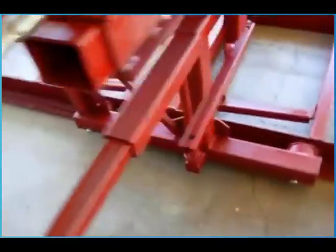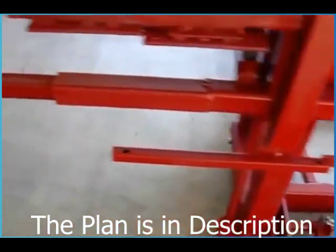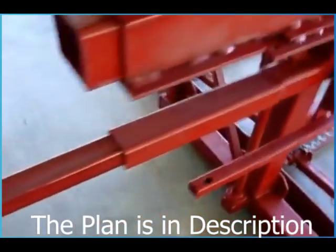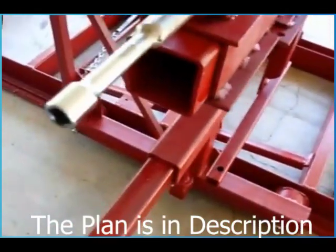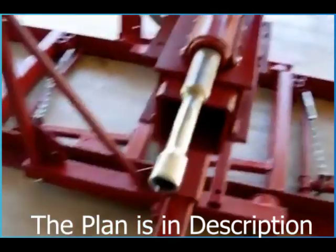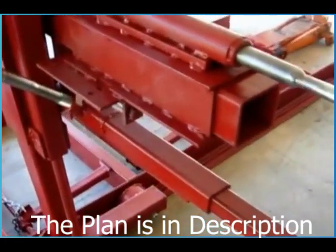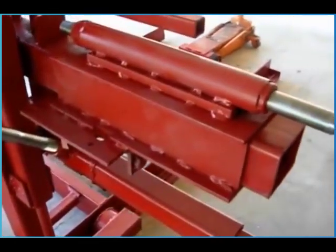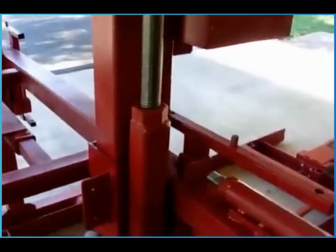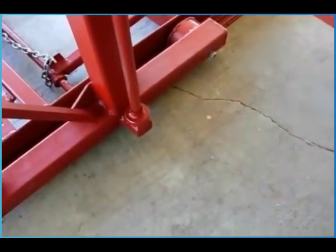On the other side of the mechanism I only have 3 bolts because I have one bolt that goes through the front that just centers it, and I gently adjust it. I wound up with a 1/16-inch toe-out over a 20-inch wheel, and that just helps make sure that the bandsaw blade is up against the guide.